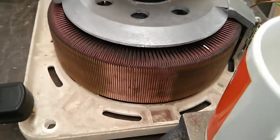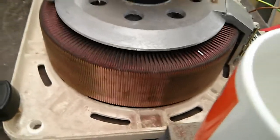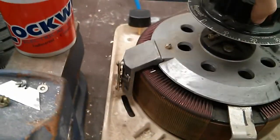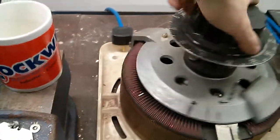Sanded the windings there because the brushes were picking up on some slightly protruding windings. They were just catching the brushes as it went round on the windings, and it would actually stop completely and it would be quite difficult to get it over.